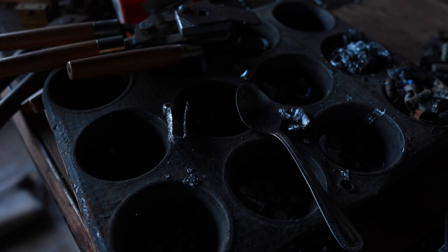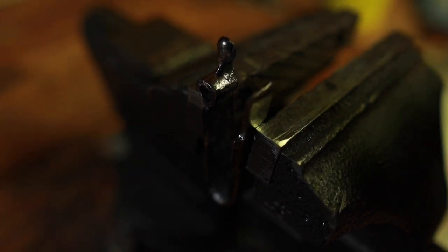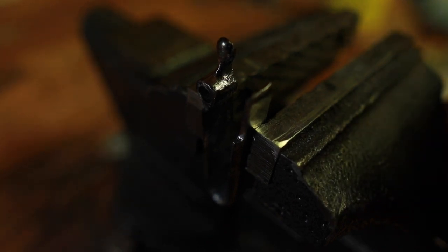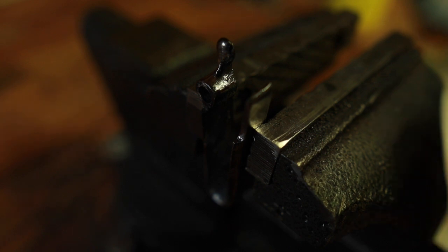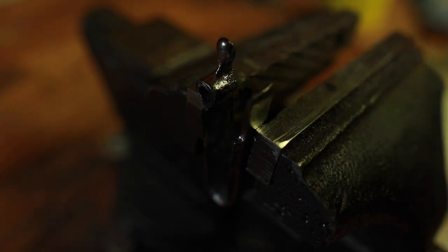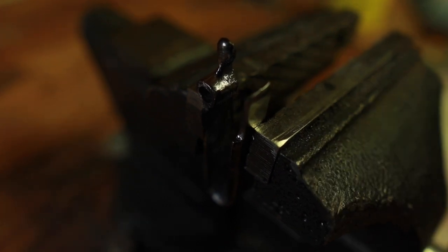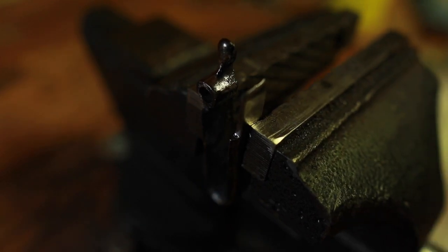We've got this piece pretty much polished back up and most of the lead removed. Now we are going to attempt to work the spring — this is something you want to do before you put it back in the gun. Put it in the vise and slowly, very slowly start working it — you don't want to compress it all the way right off the bat. By the time this is all said and done we should be able to compress it almost all the way down. I'll go that far about 20 times and then add a little more. Right now I can tell we've got a fairly nice spring here.